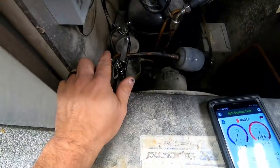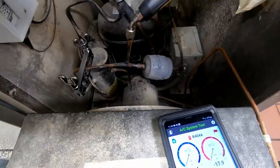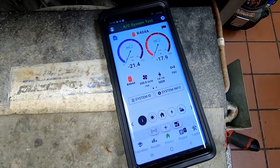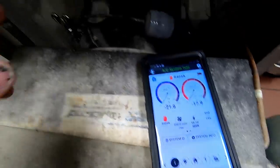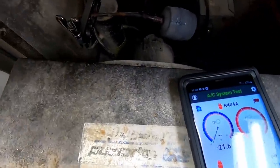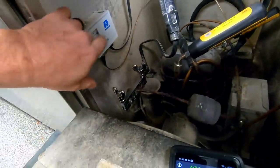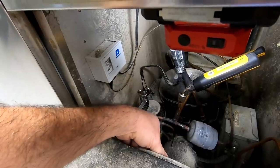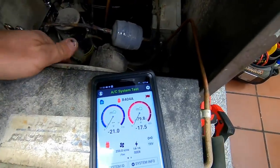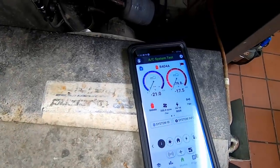I pinched it off because I was going to try to salvage the refrigerant charge and put a filter dryer in there with a sight glass on it to utilize that receiver. As you can see it pulled down into a negative 21 inches of vacuum. So our pressure switch here is junk - it's sticking. There's no reason it should have been off by 21 pounds. That needs replaced. Between the sticking low pressure cutout and likely being low on refrigerant charge, that's probably what happened here.